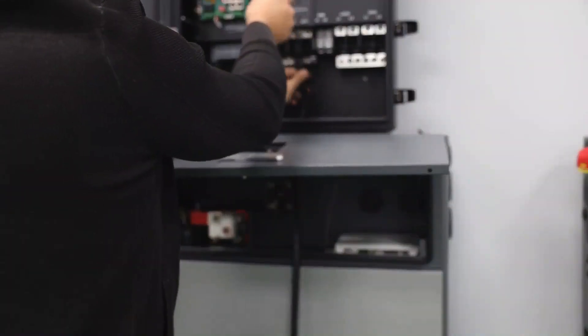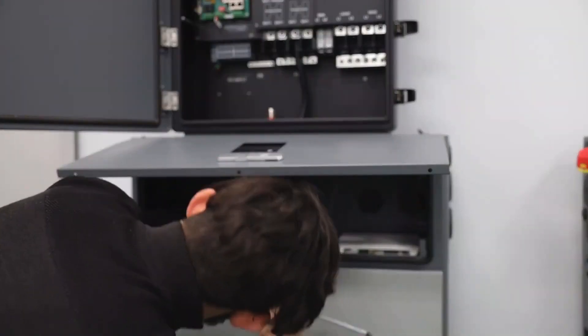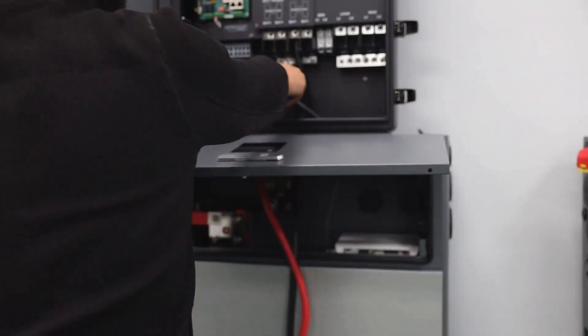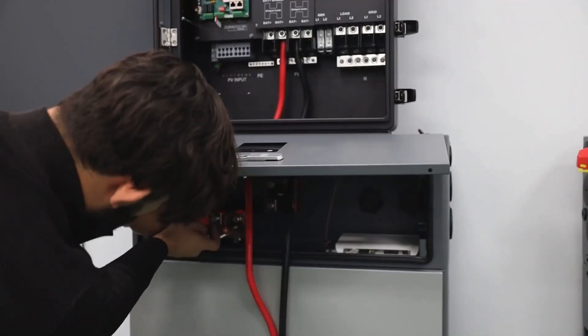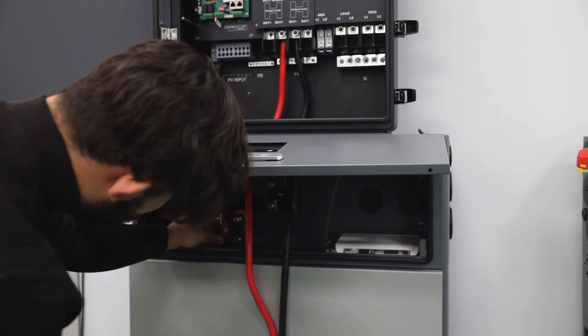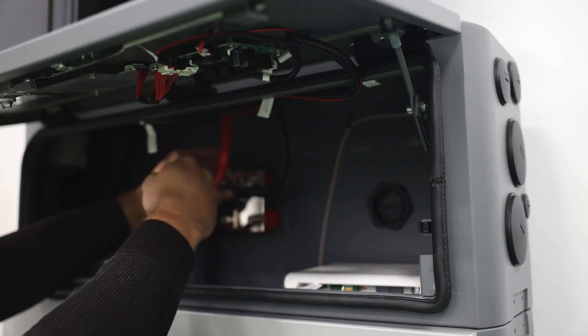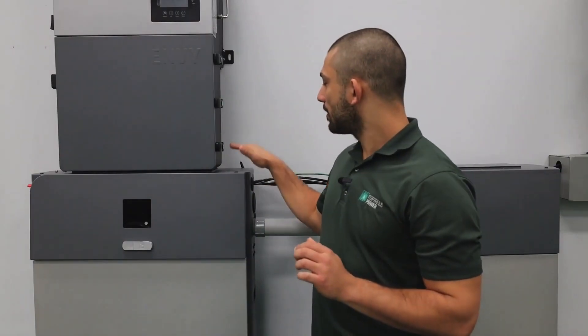The e-Force comes with the e-Way, which is short for electrical wireway, basically substituting any need for other wireways or wire gutters. It allows you to hide your AC and DC wiring, and it's also fitted with 750 MCM bus bars for your positive and negative DC conductors that will be connected to your inverter. Lastly, there's a compartment to store your Guardian, which is Fortress Power's monitoring hub.